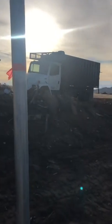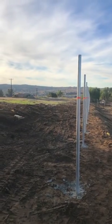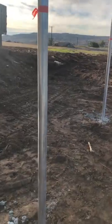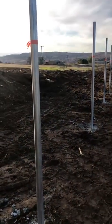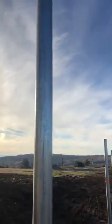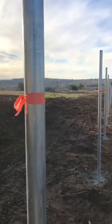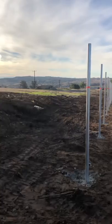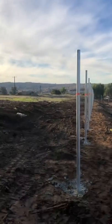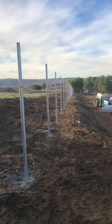In general, I start my benchmark at 60 inches — five foot even. If I measure up from the ground to this ribbon and it's over five foot, that's my gap. If I have a seven-foot fence and I'm just trying to deck my posts out at seven feet tall, I just add two feet above my five foot to give me seven. That's how I set up my fence lines for my top rail — I look down that ribbon, and if it looks good, that's basically the top of my fence.